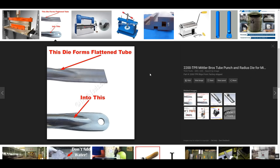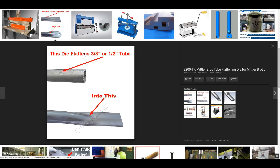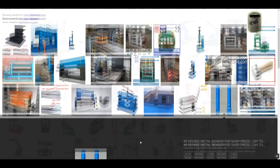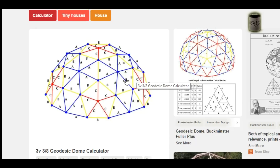Then you take a sledgehammer — or better, a press, which you can buy from Harbor Freight — to flatten the ends. Here's the type of end you're going for with EMT. A die that flattens three-eighths or half-inch tubes is exactly what we have. Then you drill a hole in the flattened end — it's nice to have a drill press for that. Consider how many tubes you'll be working with, how many cuts, how many ends to flatten, and how many holes to drill.